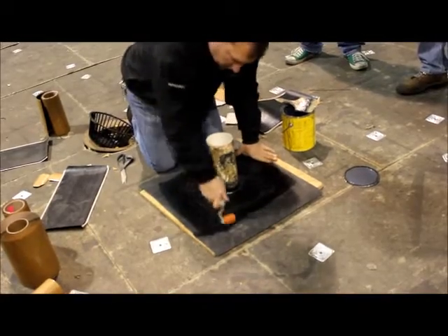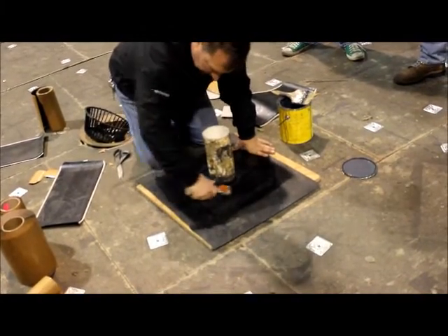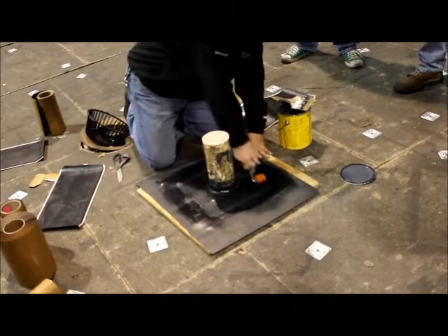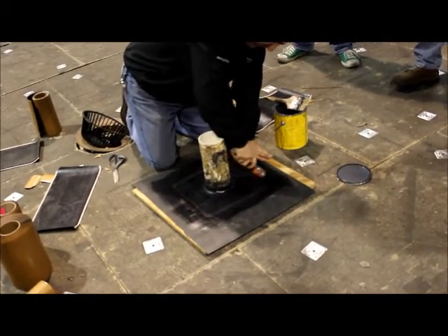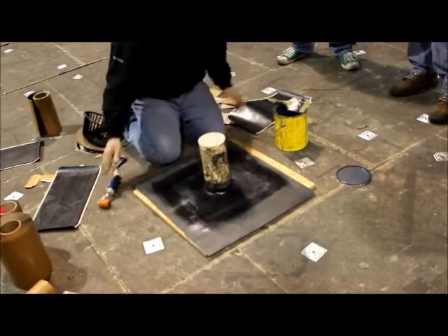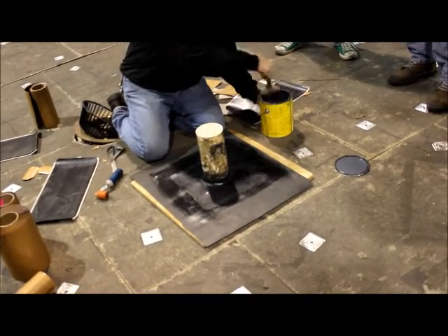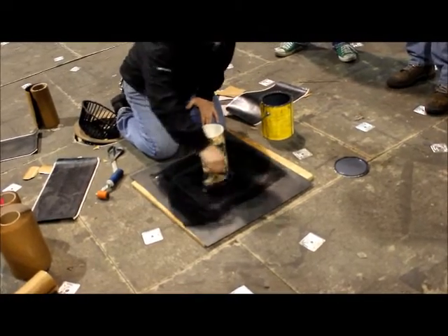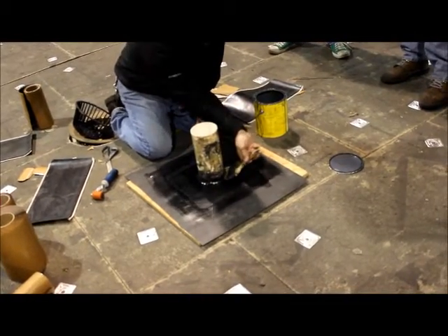Take your roller, make sure you roll it, crease it at all the creases. That's your two piece. Now from there we're going to do our wrap. Then you would prime the pipe — but here we're not going to do that. We don't want it to stick.